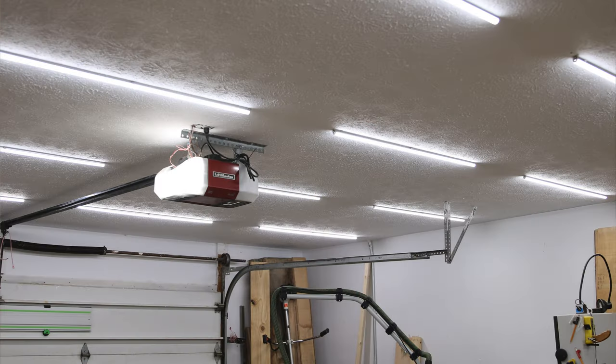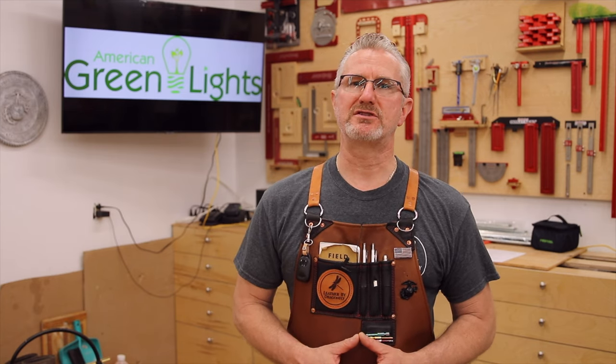The LED color on my LEDs is 5000 Kelvin, and that's important because that's the light you see at noon on a clear blue sky. The other factor is color rendering index, or CRI — the measurement of how colors look under a light source when compared to the sun, measured as a percentage. The CRI of these LEDs is 95%, so it's really close to the sun.